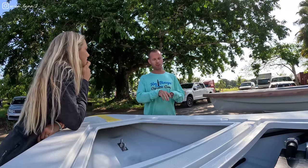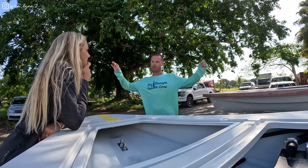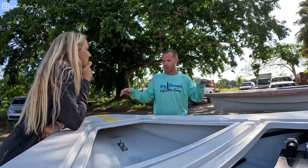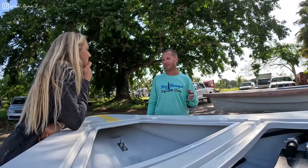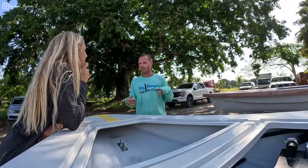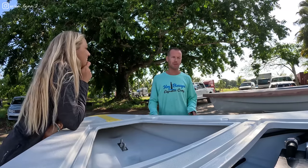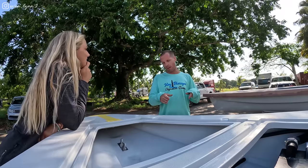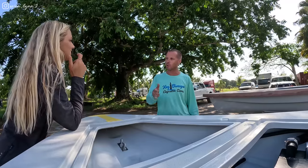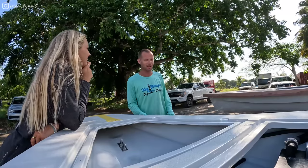Me and my dad just started with cardboard templates — alright, how does it look? We did it station by station, put a piece of rope on it, came up with the shape, then strip-planked it — cut plywood, put it on, puttied it. We had the shape, and then my buddy said, 'Louie, put some more V on it — this thing's going to be like a Carolina skiff.' I grew up on a Carolina skiff, so we put more V on it. I made this funky pocket transom — I had no idea what I was doing. I was making a mold for a boat I'd never tested. I made it thin, we popped it out, made a boat off it, hand laid it. I read through all of Chris Moorjohn's writings — I was basically stalking the guy on the internet.